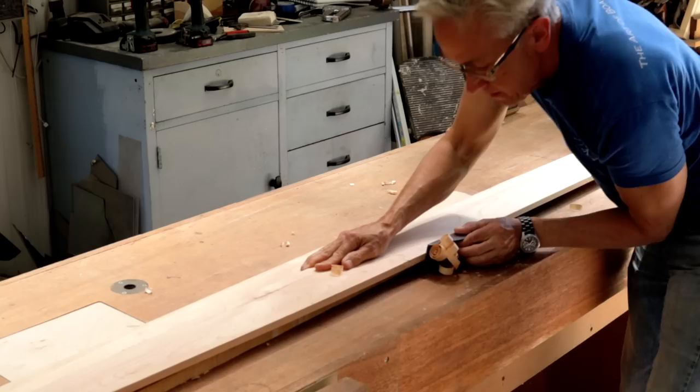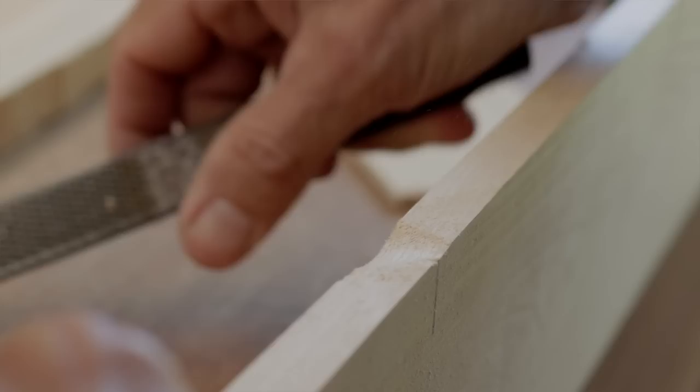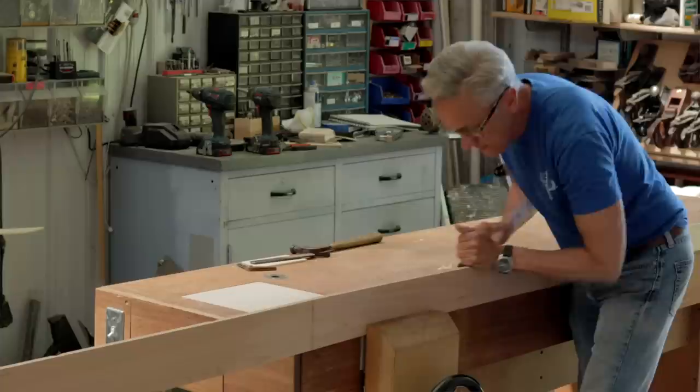Once we have that shape all cleaned up, we can then go to the boat and measure the bevels and record them. After we've recorded the bevels, we can then go to the plank and cut that bevel at each station. We are then prepared to cut the rolling bevel with a simple hand plane and connecting those slots together. In this example, all I need to do is look for that rasped area, and as I'm planing it down, slowly watching it disappear and cut down to where it's at the same bevel.